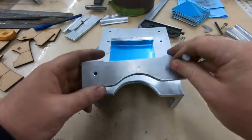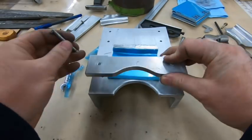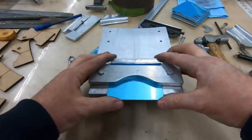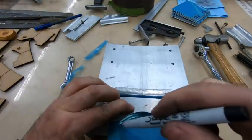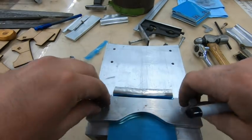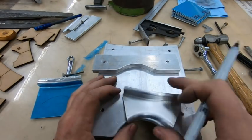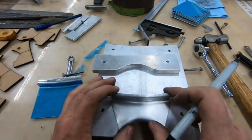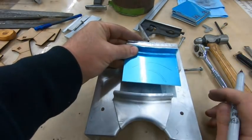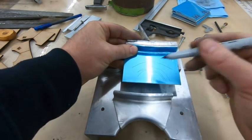Now it's time for this other member here. I'm going to put it on quickly and temporarily. I've got this cut out so that curve will sit in there nicely — line up my center line. Basically we're forming this curve here, which forms very nicely on the aluminum. But to do that we need to relieve here. I'll take this over to the punch and knock it out, then clean up that radius.